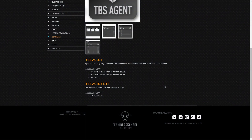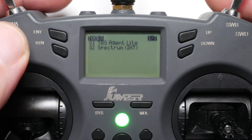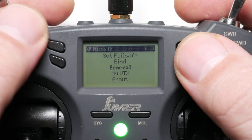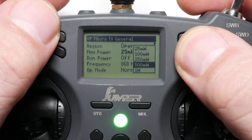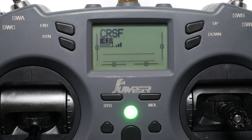To comfortably adjust the Crossfire Nano module on your radio, I recommend using the Agent Light Lua script by TBS. I leave a link to the content of my SD card in the description — just unpack it to an SD card and you should be able to follow the next steps. Long press the system button. On the tools screen select the first entry, TBS Agent Light. Select Crossfire Micro TX. In the next menu scroll down to General. Disable dynamic power by setting it to off — you just want to disable this for testing to make sure you will be able to transmit on full 1W. Set max power to 1W. Now monitor transmitter and receiver. I have run about a dozen packs through the radio to make sure everything is working properly before presenting it to you, and it worked beautifully.